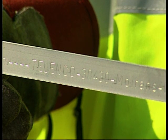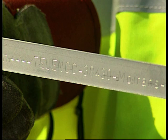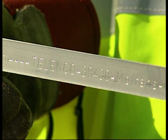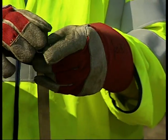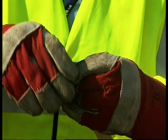Alternatively, the Universal Pole Bracket can be attached to the pole by means of the 20mm by 0.7mm stainless steel banding system. Cut two lengths of banding to the required length. Take a 20mm stainless steel buckle and slide the banding through the buckle. Bend the banding as shown, ensuring that a minimum of 25mm has been bent back.